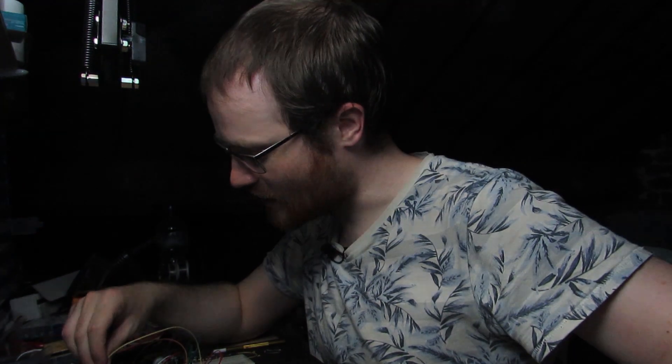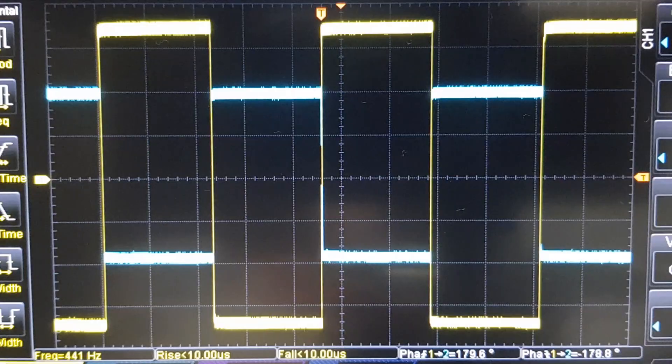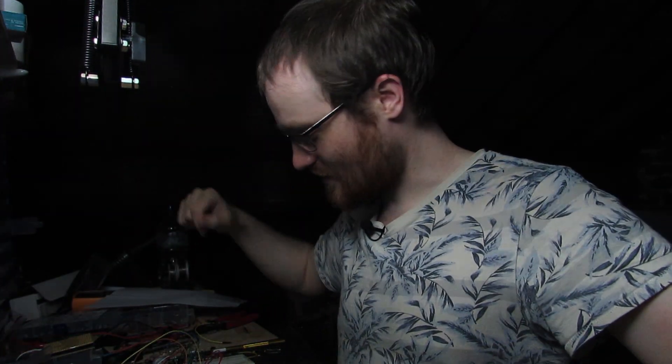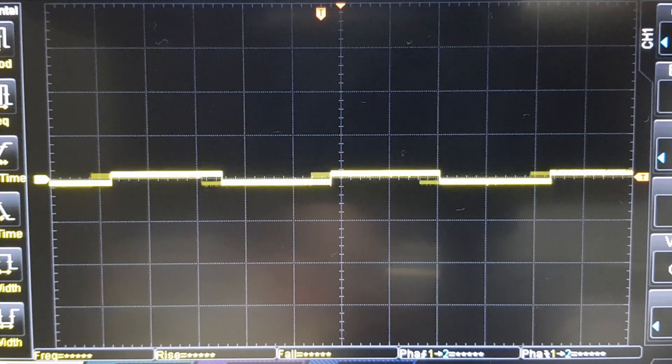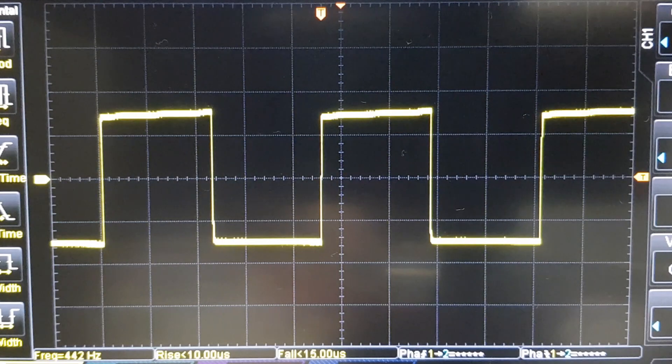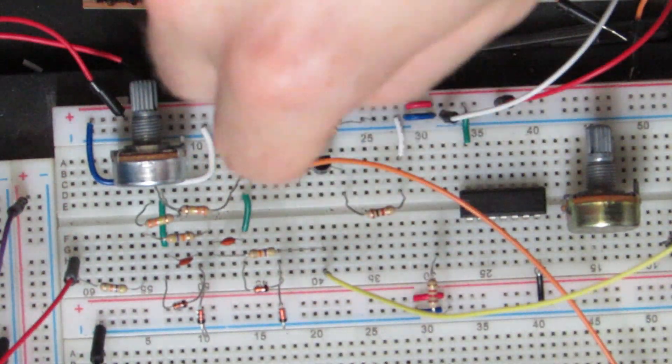The amplifier looks great until we compare the input to the filter as the yellow signal and the output of the amplifier as the blue signal — we see that the output of the filter is actually higher than the output of our amplifier. Something has gone wrong. If I remove the decoupling capacitor, removing the amplifier from the circuit, you can clearly see the transistor is loading down the output of the filter quite a lot. This is very bad. The worst case output impedance of the filter is about 140k to 150k, but the amplifier input looks like about 100k — so we'd already expect some attenuation.